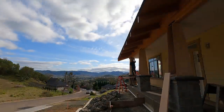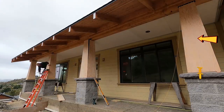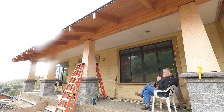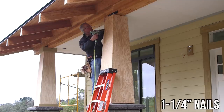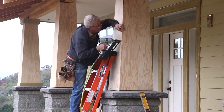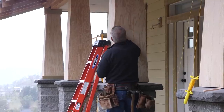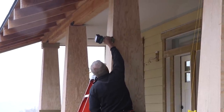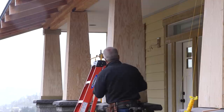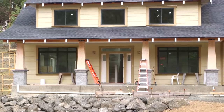The center line I drew on the material to make the cuts was vital to the installation as well — it was the only way to keep the center line of the columns plumb as I went. With the three-quarter inch thick material, inch-and-three-quarter nails on about six-inch centers from alternating sides going up the corners made glue unnecessary and pulled these things up tight as a drum. The last step before putting the collars around the top and bottom was to run a three-sixteenths radius router bit over the lengths of the corners so nobody ever gets a sliver.